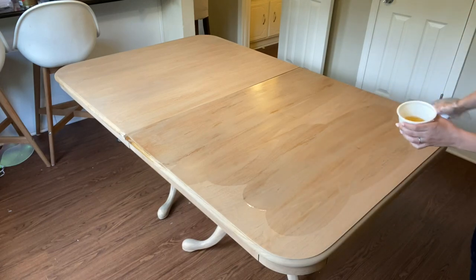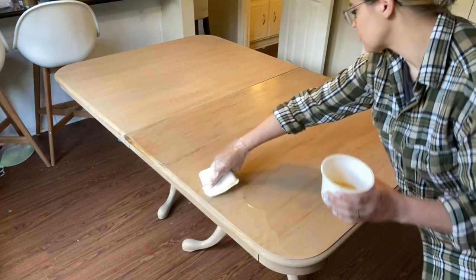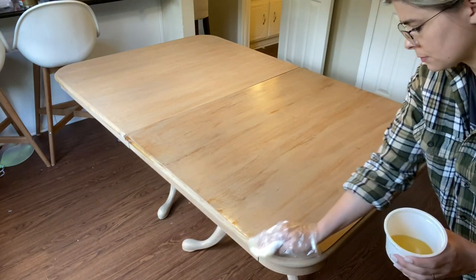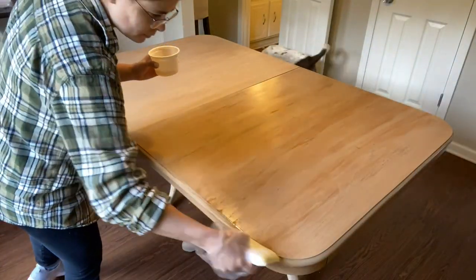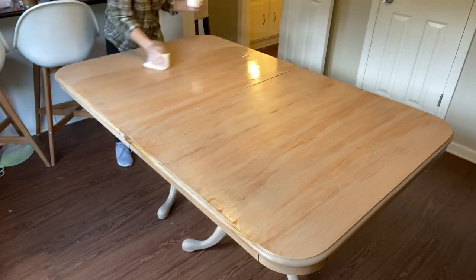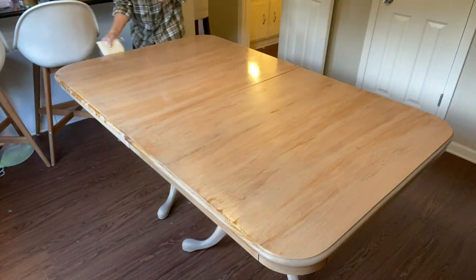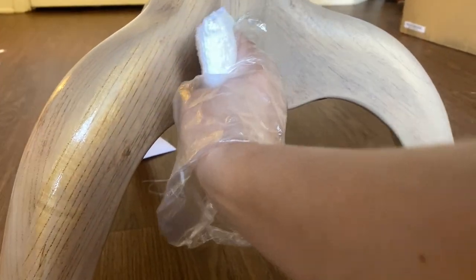You're not going to regret applying a water-based top coat, I don't think, unless you're doing something terrible to your table. The water-based top coats these days are so durable. Even the organic ones. I used Earth Safe Finishes, an organic and non-toxic water-based top coat, on my table, and it's held up so well. I think you can't go wrong. A lot of people are so scared that their furniture, after they've worked so hard on it, is going to get damaged. But you see these people that have damaged furniture that didn't apply a top coat at all. That's a lot different than applying a top coat. Even a gentler top coat is still going to be really durable unless you've got it outside or something.